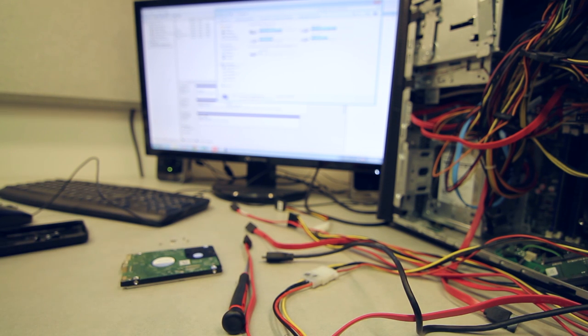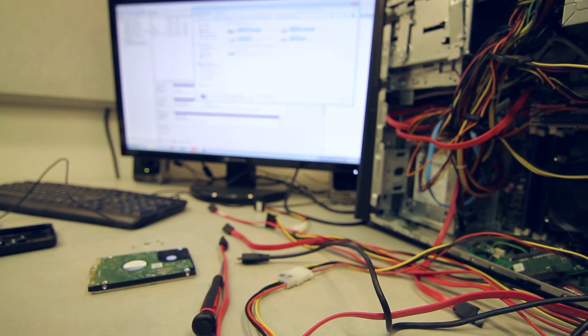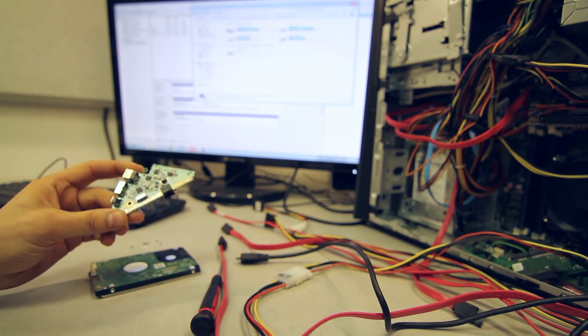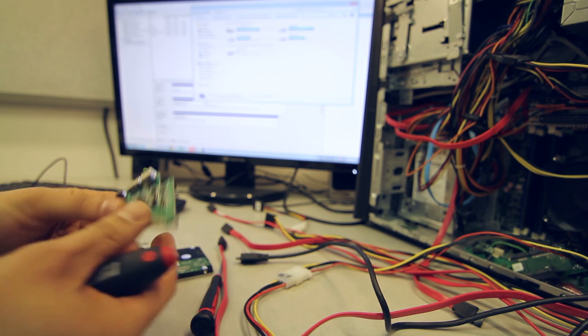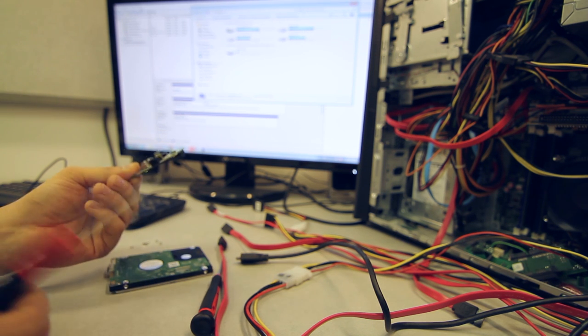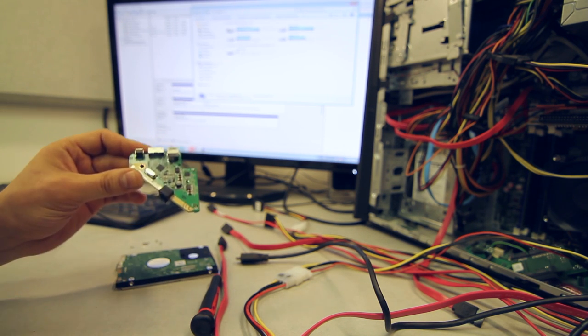Now, you can decrypt it with the Western Digital product, and that comes on Western Digital MyBook drives. This may not be a secret to somebody, but it is a really valuable piece of information, because a lot of people would try to convert it and still not get access to it, and the reason for that is probably the encryption factor. So this board will perform on-the-fly decryption of your data if we're working with a clone copy on a SATA drive.